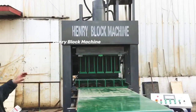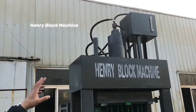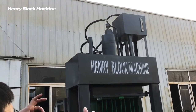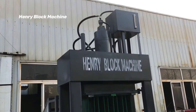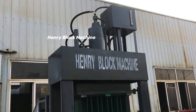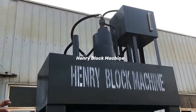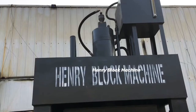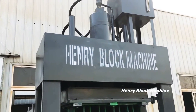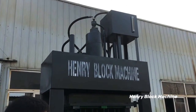You can see now there is a new updated soil brick making machine, powered by what we call the fast speed hydraulic cylinder. The outer diameter of the hydraulic cylinder is 270 millimeters. We also equipped two small hydraulic cylinders — they power and compress the blocks first, and after the system receives the signal, it triggers the big fast-speed hydraulic cylinder to compress the blocks.